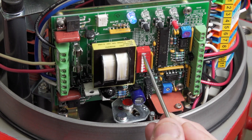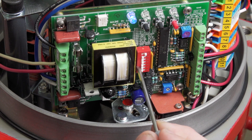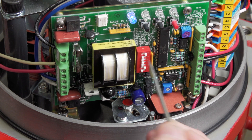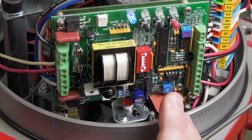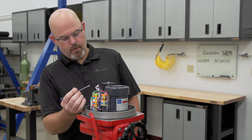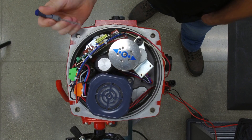One way of calibrating the TMC3 modulating card is to turn dip switch 1 on, which puts it in manual mode, and dip switch 6 on, which puts it in auto-cal mode. Once it's in calibration mode, you hit the red button and the actuator will calibrate itself. It's going to find the mid position and bounce back and forth three to four times in the mid.